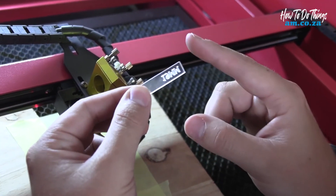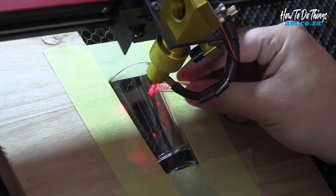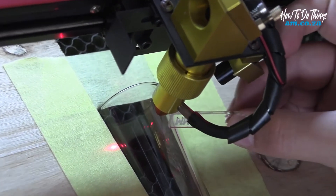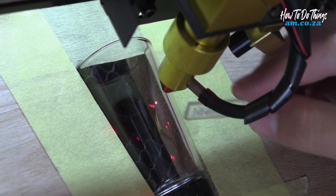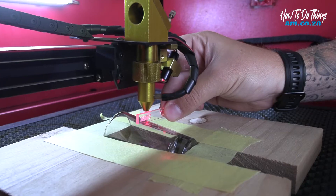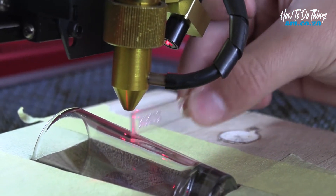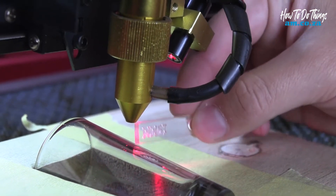This laser uses a focal height of 10mm. Each laser has a different focal height — some bigger lasers will be 20 or maybe less, but in this case we're using 10. So we put the gauge underneath and move it to the middle of our shot glass, making sure our focal height is perfect. There it is — it fits directly underneath with a little bit of play, which is perfect because this is halfway along the glass where we are actually engraving.